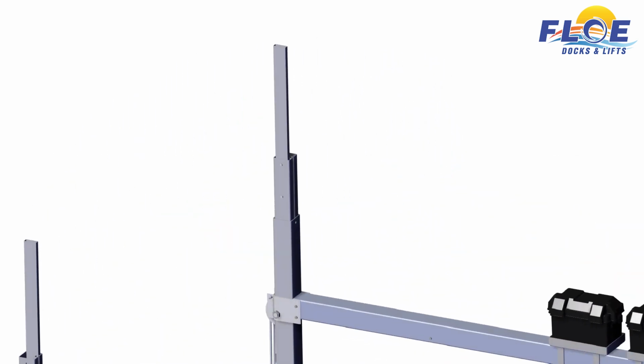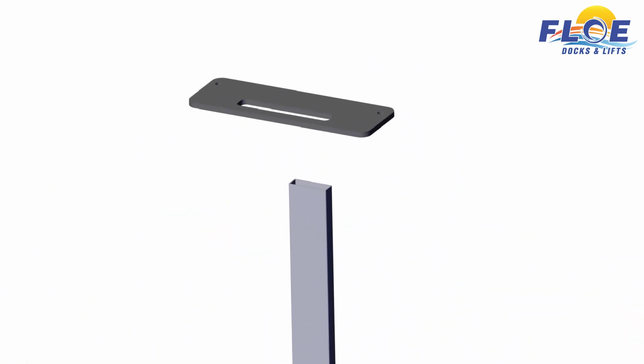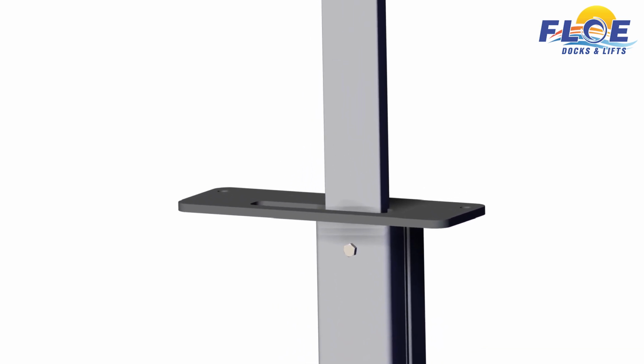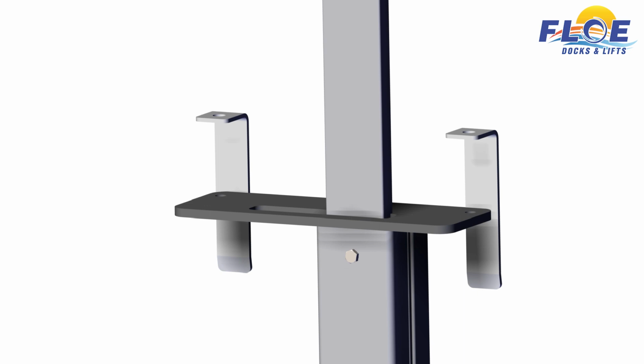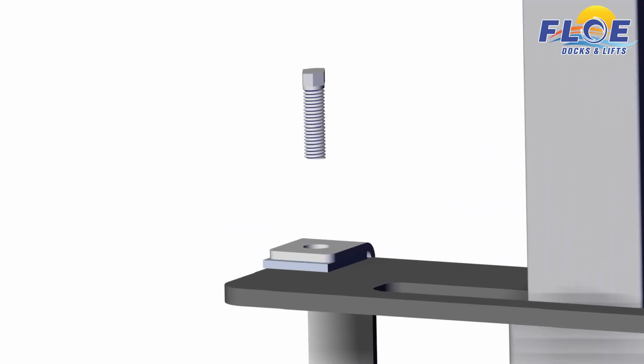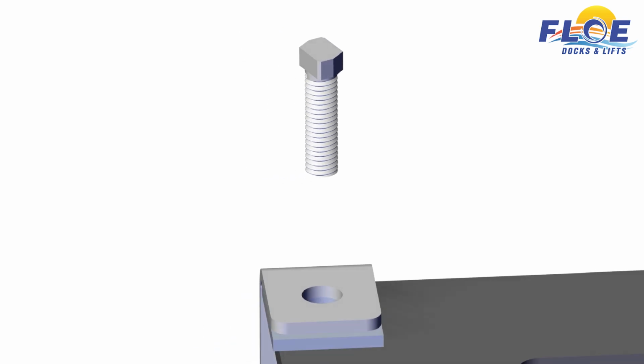Locate a containment bracket and slide it over a vertical guide. Add 2 guide tabs and 2 spacers to the containment bracket, as shown. Make sure the guide tabs face the outside of the lift. Slide a couple 1 1/4 inch special bolts into the tabs, spacers, and containment bracket as shown.